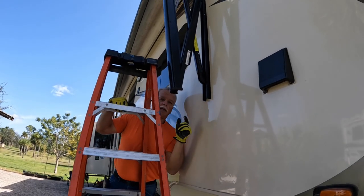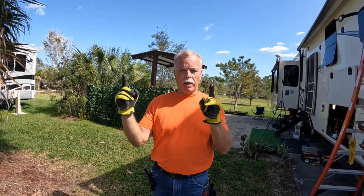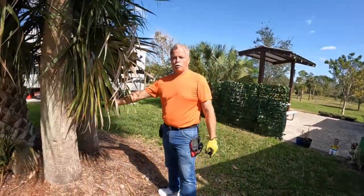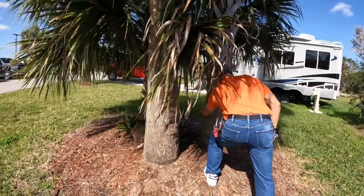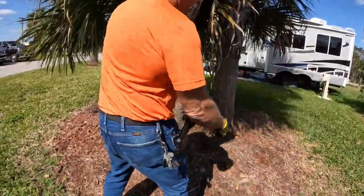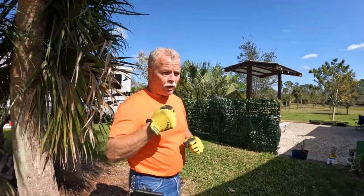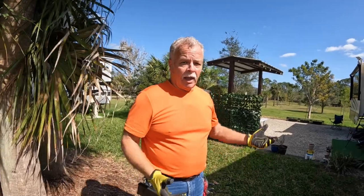Just to give you an idea of how I straightened it: I had the two-by-four and I ended up screwing the track to that two-by-four, leaving whatever was bent out about this much. Then I ended up using these two palm trees as a focal point or leverage. I ended up putting the piece that I was bending here and used the two-by-four to bend it this way in order to straighten it out. Because it is extrusion, it would have been very difficult just to hammer it out. You actually have to feel it to see where I bent it — just being creative, thinking out of the box, and it's working great.